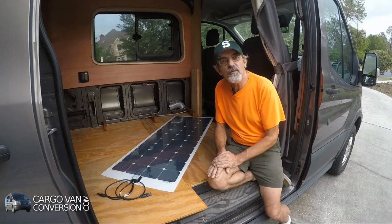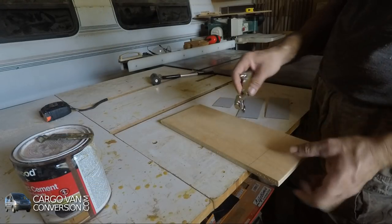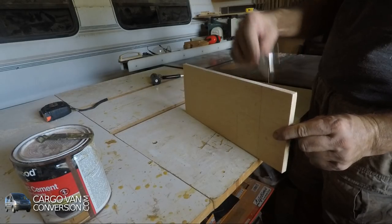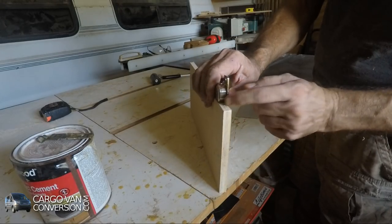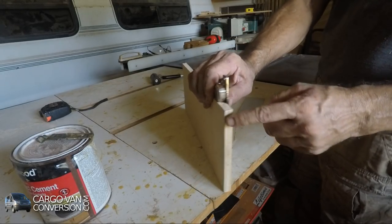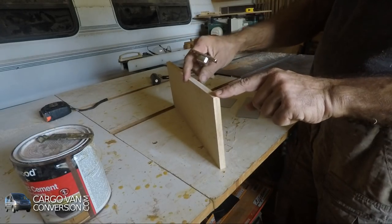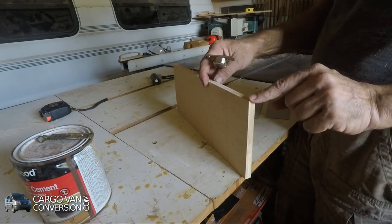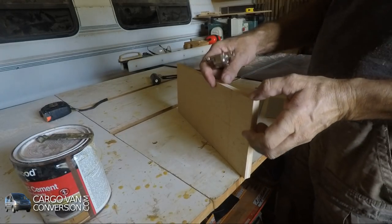I also continued working on the cabinets by honing my hinge hole drilling skills. The next issue is the cabinet doors — they will be built with concealed hinges, the European style. You put the hinge on the cabinet door and it has to go about half an inch deep, so the wood for the cabinet doors should be at least five-eighths of an inch thick, otherwise it would go through the wood itself. I have difficulties getting five-eighths and I don't want to go to three-quarters, just because of the weight.